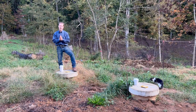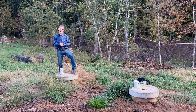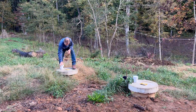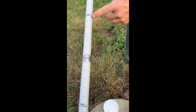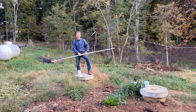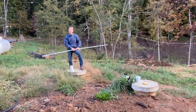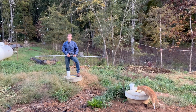We have a long way to go — we've only done the back half of our house roof. We also have the front half and two sides of the barn. So we have a lot more water going into this system, but it's nice to see that it's working so far. Right now I'm getting about 650 gallons per inch of rainfall and I measure that with a cheap PVC pipe. I have the gallons marked in the cistern on this pipe, so I'm able to stick it in there and tell how high or low the water is. Thanks a lot for watching this week. We hope you've learned a lot — leave a comment if you have any improvements or questions. If you haven't subscribed, please do so and join us on our journey. We'll see you next time.